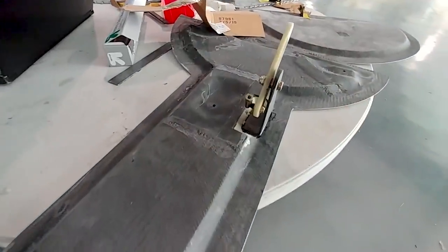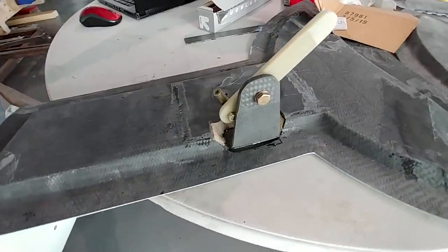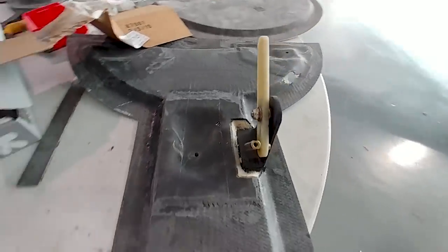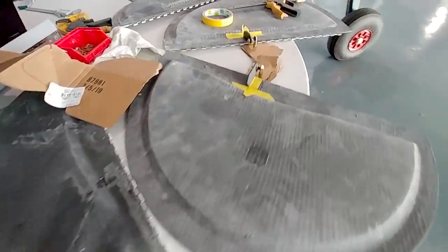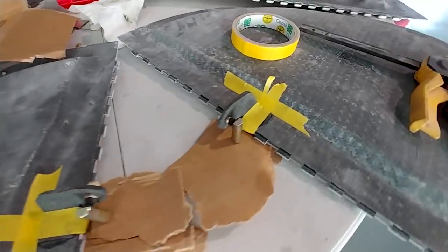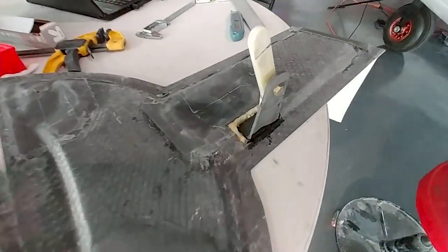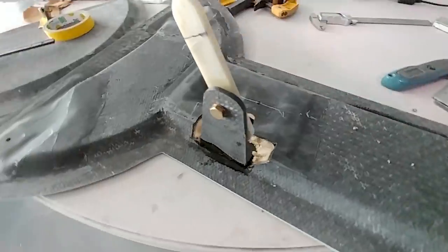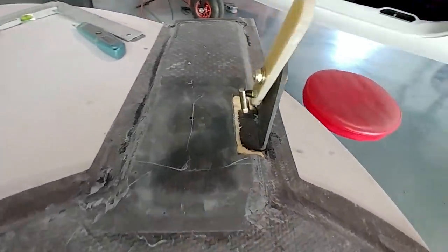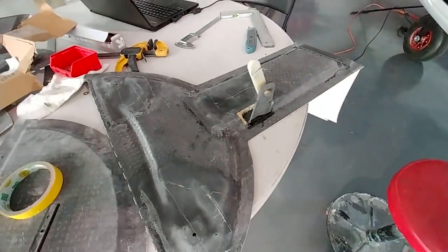What I've done is cut out the core from that part of the door so I can mount the bracket nicely on the outside skin. I've bonded it into place using some T-88, and later on I'll do a layup over both of them to strengthen them some more. That little swing arm has some bushings on it so it rotates nicely, and I'm hoping it all works smoothly.